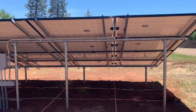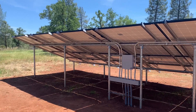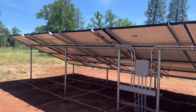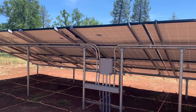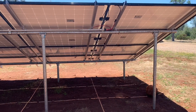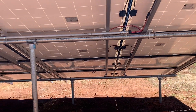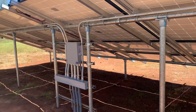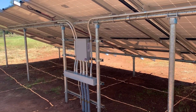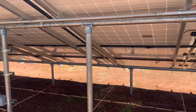This is just going to be a quick overview. This is really just a standard ground mount system. It's Ironridge rails, it's the SolarWorld 295 modules. This is off grid. Right now I'm running strings of three — I wanted to see the difference in voltage drop and I'll play with some other stuff. I'm probably going to wind up kicking this to strings of four later. What I want to show you is the infrastructure. I ran the MNPV12 on this job — this is the first time really using that. I normally do the MNPV6, so it has all the string breakers in there.